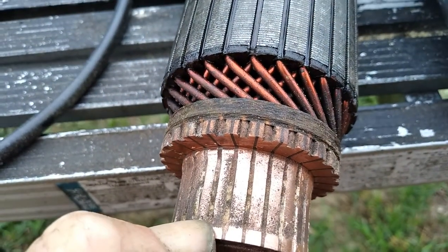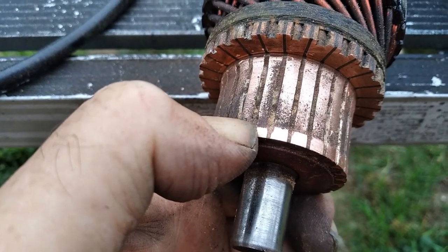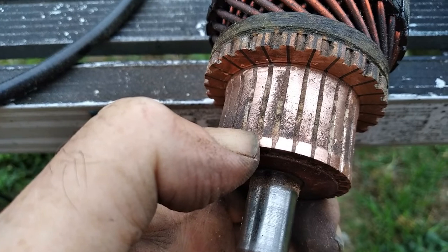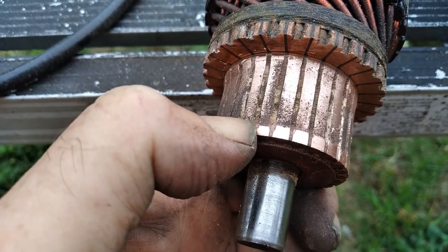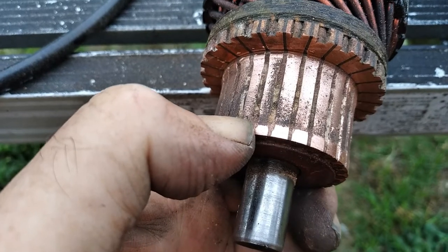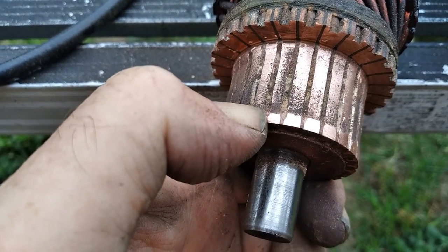I remember one time a guy had brought like maybe a '73, '74 Harley Davidson Electra Glide to me, and it has a wet dry clutch. That's what they call it. Basically, it's a dry clutch inside of a housing that has oil in it. I serviced the bike, got it running, sitting there idling, went outside, popped it in gear, and it took off across the parking lot because the clutches were stuck together from oil sitting in there on them. And I mean, that's a lot easier to take apart than this thing. So I pulled the primary cover off, took the clutches out, cleaned them in lacquer thinner, sanded plates in between the clutches, and good to go.